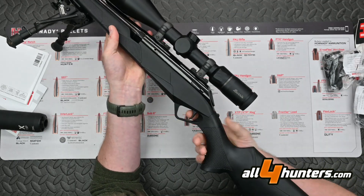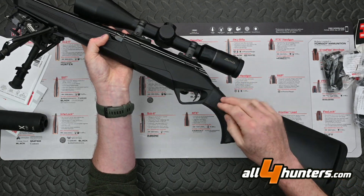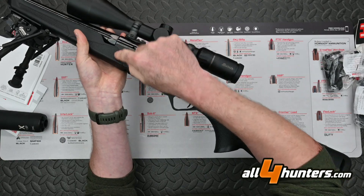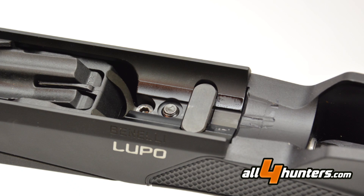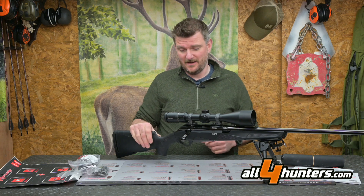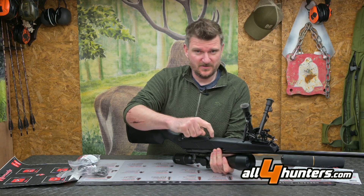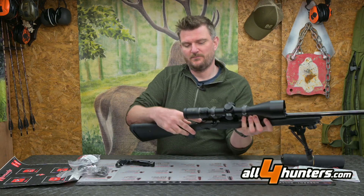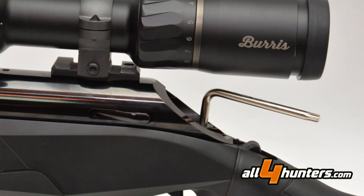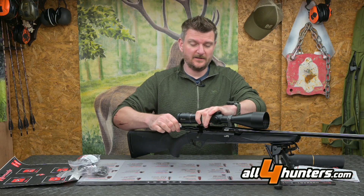There's plenty of space for gloved fingers because the trigger guard is aluminium — part of the chassis — while the external stock is polymer. The chassis centre is hard-anodized aluminium with a large recoil lug that fits into a rebate in the bottom of the action, which should be very stable long term. The one critique is that when disassembling, the rear action screw is underneath the scope, though a T25 Torx key is supplied as an L-shaped key, so it works fine, just a little fiddlier than some rifles.